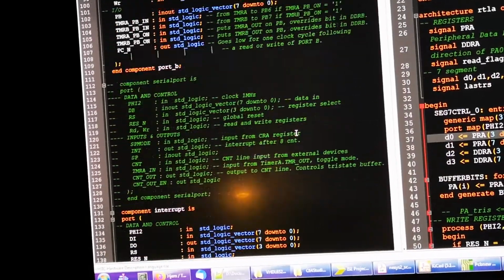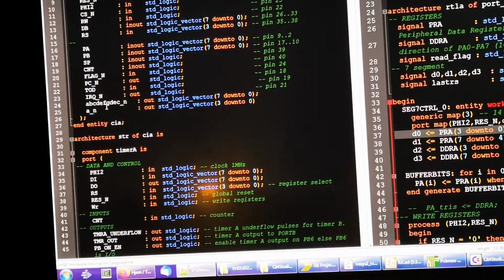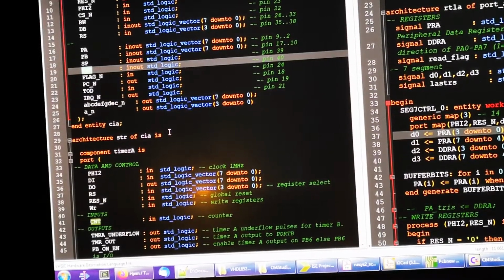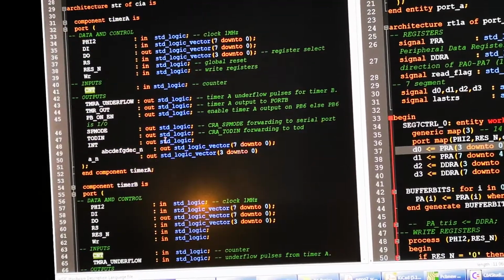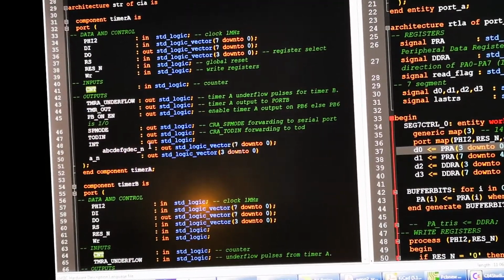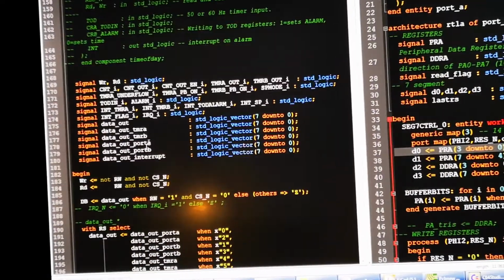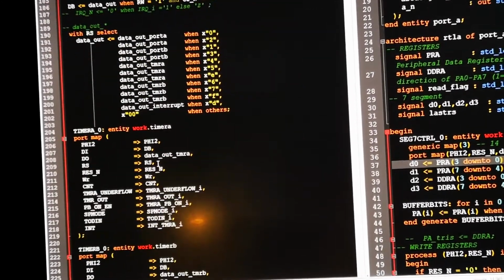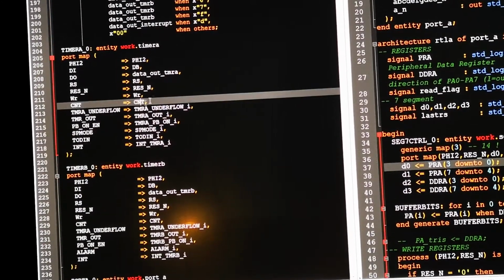So what was wrong? The thing is that in the top layer here, we have a port, which is like the whole chip. And then we have count. And then sometimes we have internal signals to connect everything together. So that was what I was doing. Here I made a signal called count_i, and then on timer A and B I used count_i. Now I have removed that.